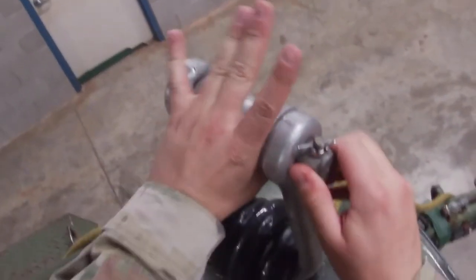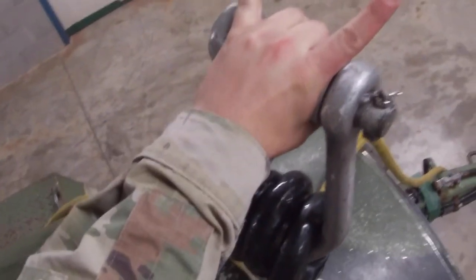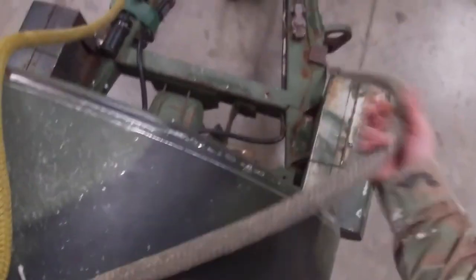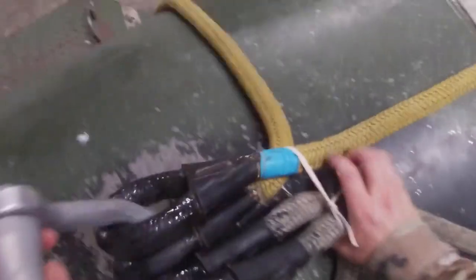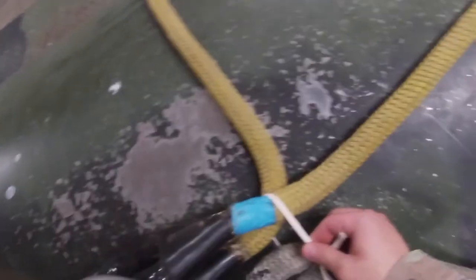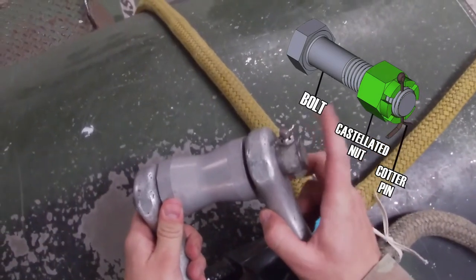Now you're going to use that phase 2 gang sign. Remember, my two outside fingers represent the two outside sling legs, so you're just going to trace: this one goes to the front, your second traces to the back, your third traces to the back, and your fourth is traced all the way to the front. Now this load is going to have one cluster breakaway. Make sure your breakaway goes one time and one time only, and it is quarter-inch cotton webbing. You're going to check your bolt, your castellated nut, and your cotter pin.